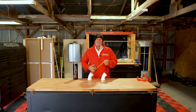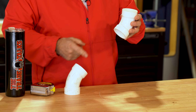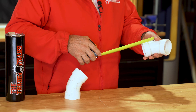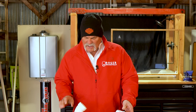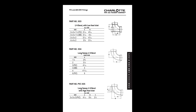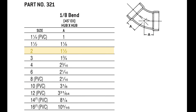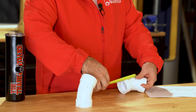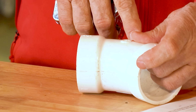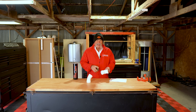Here are the two 45s. What you're looking at is center to center, and we're trying to figure out how long of a piece to cut. We need to figure out what the makeup is. Looking at it, I'd say about one and a sixteenth inch, but I want to make sure. Looking at the Charlotte Pipe and Foundry Company's layout sheet for PVC and ABS DWV fittings, it calls an inch and a half for makeup. So your A piece is an inch and a half.